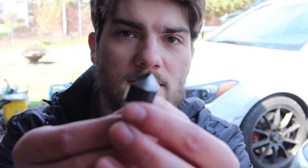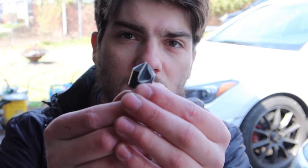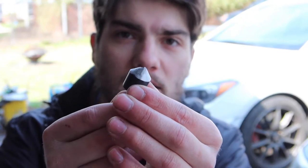Hey, how's it going? Nick here with a quick tool tip. Today we're going to talk a little bit about countersinking holes in aluminum. Now if you go to your local hardware store, you might see a countersinking bit that looks something like this, that has one cutting edge. That's good for wood, not so much for aluminum.